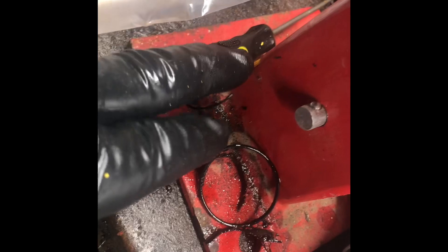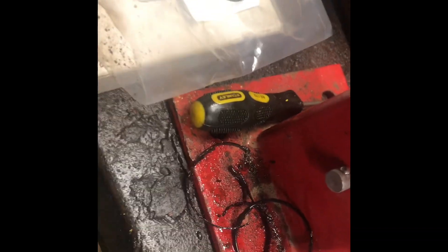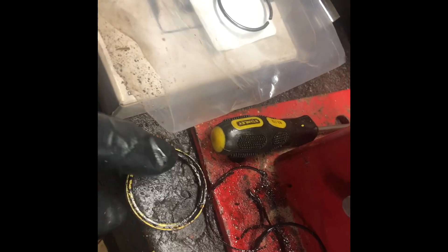There's the outer seal, and then inside there's a groove for the inner seal. Here are the replacement seals: this is the one that goes inside, and this is the outer wiper seal. It comes with a new snap ring. This is the inner seal that was in there — as soon as I pulled the rod out, the pieces just came out. And this is the original wiper seal. I used a little 90-degree pick to get the seals out — I had to get behind them. This one has a steel backing, so I just tapped behind it in a couple of spots to get it started, then it pulled right out.